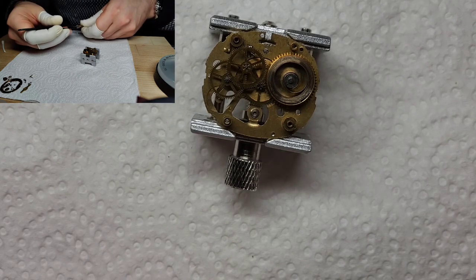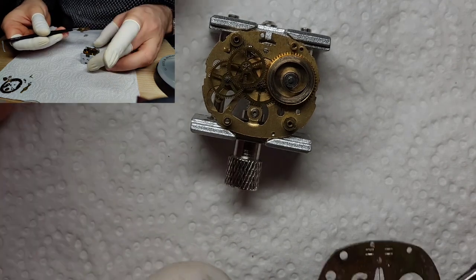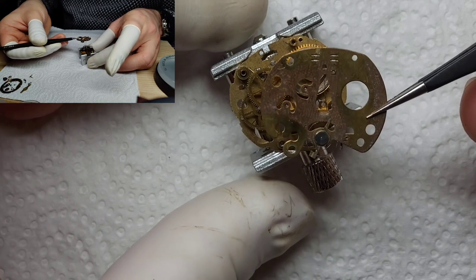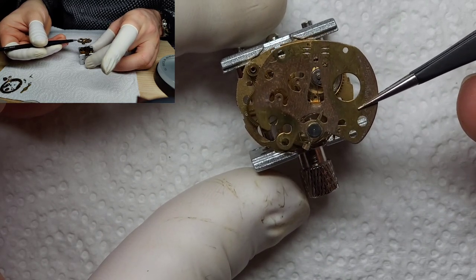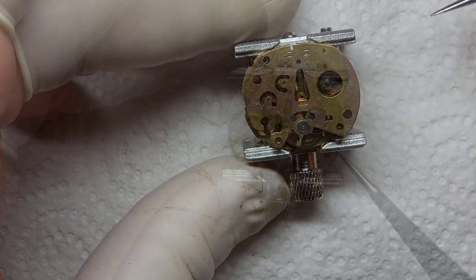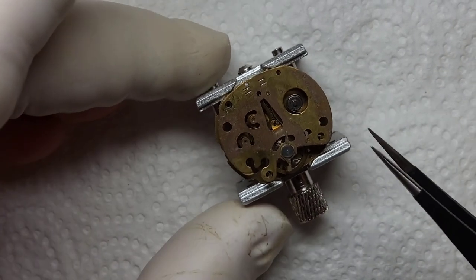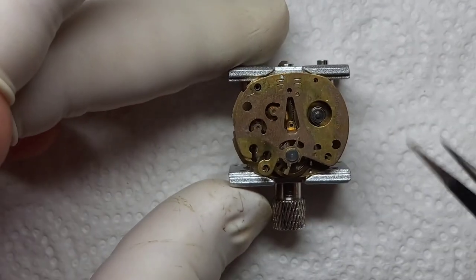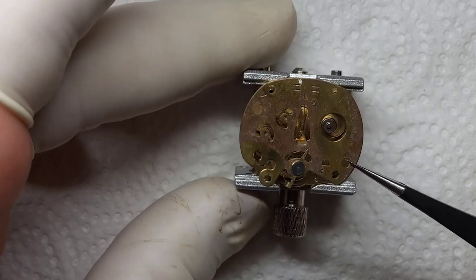You need to make sure those gears are meshing together, otherwise there's simply no way to get the pivots to line up with the corresponding holes. There's no pallet fork to align to, which is quite curious, so all we've got to do is make sure we're sitting in that cup with its oil and then it should just be a case of aligning it all up. Then you'll realize there's been a mistake - we've actually got to get that bent tab underneath that intermediate wheel, because that's what the second wheel aligns onto. Whoever thought that was good design won't be thanked.